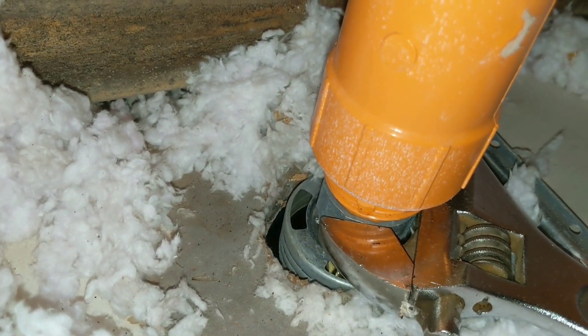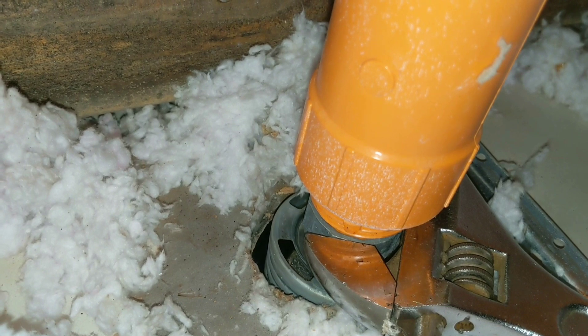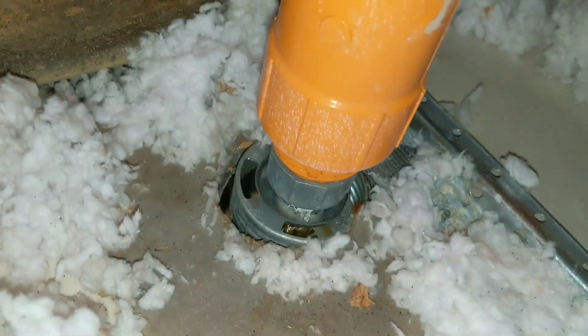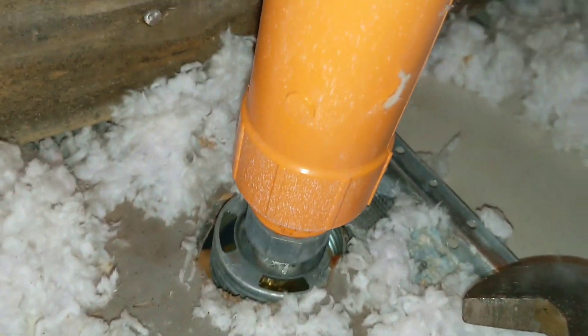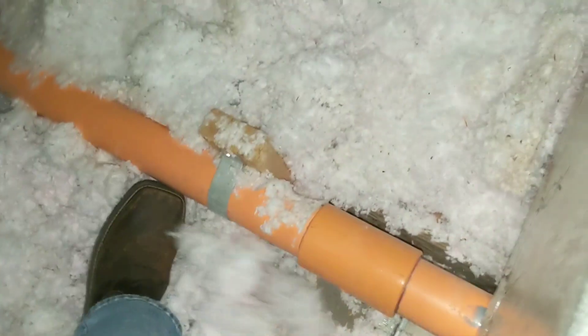Go with it. Snug? That's it. That's why the head was leaking — they tried to put it in and they didn't have a tool either, so the head didn't even tighten; it was screwing in on this adapter. But I think we got it. Let me get out of this hot attic. Make sure you move all your insulation back over there — the whole thing should be covered with insulation and it's not, so one day we'll be coming back to fix a busted pipe.